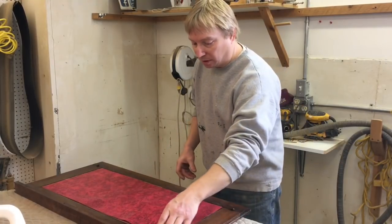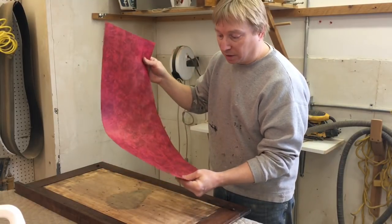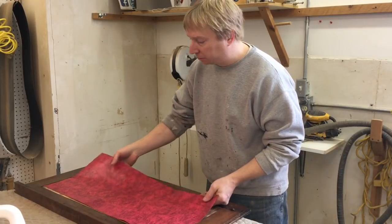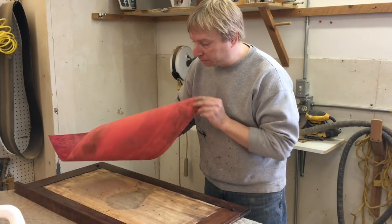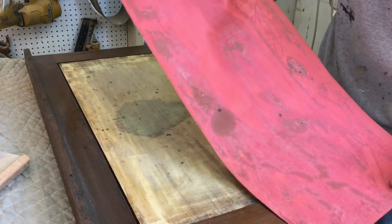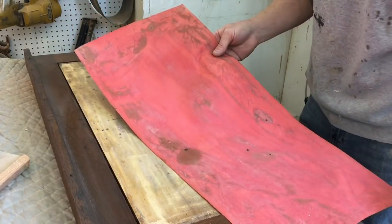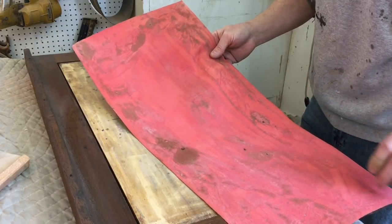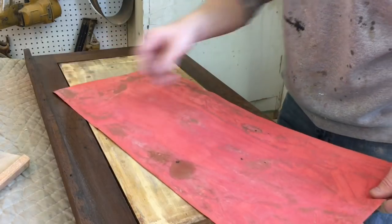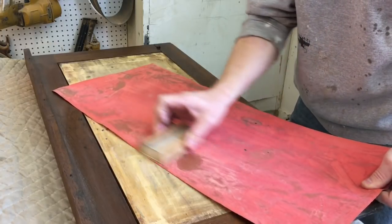This is the original oil cloth. It was a little bit loose so I carefully peeled it off so I was able to do some touch-ups on the finish. Now I'm going to reinstall it. When it was originally installed, it was installed with hide glue — you can see they just kind of dribbled the hide glue on the back and then laid it down. It was a little bit rough so I very carefully took a block of wood and some sandpaper and just kind of smoothed out the backside.